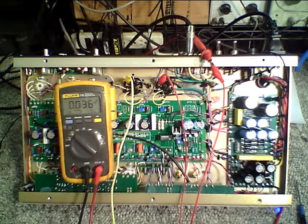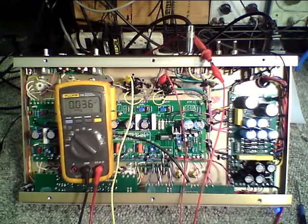Another good thing to check while doing this is to make sure your AC power line is at the proper voltage. If you measure AC volts, you can measure right across the power socket — the two outer pins should give you 120 or 240, or whatever depending on where you are in the world. The bias voltage does not change; what you're measuring is DC volts at 36 millivolts, and you should use a digital meter because most analog meters will not pick that up. The meter and test leads combined are probably about thirty to forty dollars, which is significantly less than the bias meters people sell — and you can't use a bias meter on these amps anyway, because they've got a one-ohm resistor on each power tube cathode, which gives you the test point to measure with a proper meter instead of using an outboard testing device.